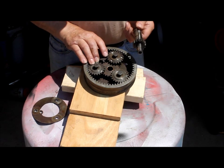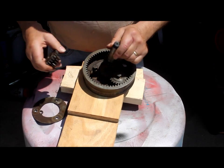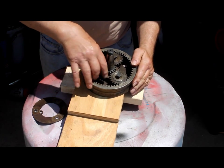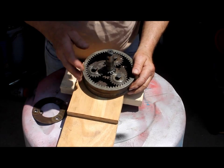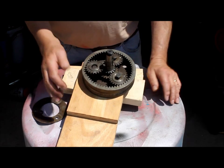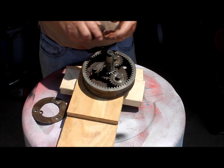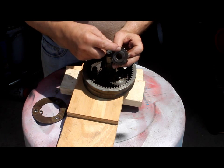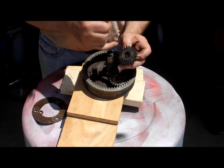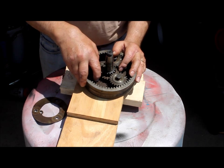So you've got it back together, and you have an older model with unmarked gears. How are you going to get it going? Well, you bring two out and bring one out — you get two going, then slowly work until it goes back together. I just happened to drop it in time. Now, I only threw one gear out of time. Funny thing about these gears — if you check, there's a way of checking to see if the valley of the big gear matches the valley of the small gear; that's a timing mark. There happens to be three of them on there, so I may have put it close enough to another timing mark to let it run.